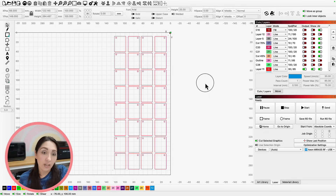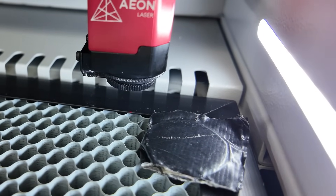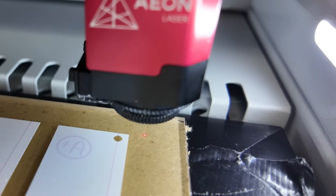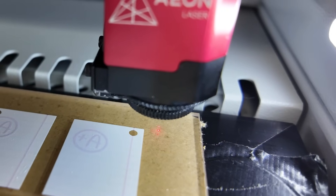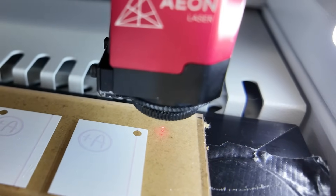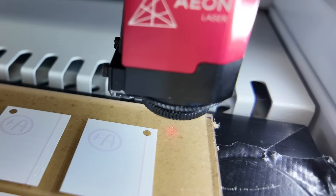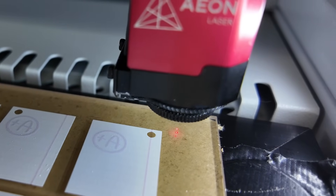Let me turn on the laser and set the target positions. For the first target position I prefer to set it up manually. I like to line up the first target on my own without the software arrows. As soon as I'm on the target — see it right there? — it brightens up. If I'm not on the target it's not as bright, and then boom — do you see that? In person it's very apparent. Not on target, on target, not on target, on target. That's why I like the dot so teeny tiny — I know I'm spot on every time.